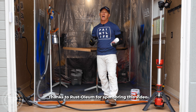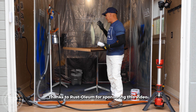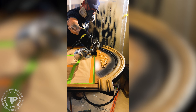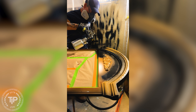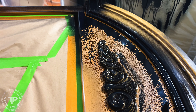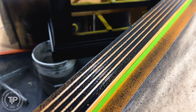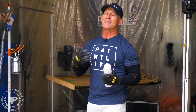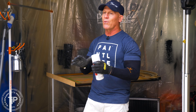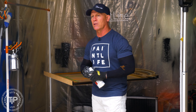Today I'm going to be talking about resolving fisheye problems and priming furniture. If you haven't heard of the term fisheye, that's a result of what happens if you've got a contaminant on a piece of furniture, cabinets, or some type of wood painted surface where the paint or primer will fisheye away in a circular pattern. There's a surface tension difference between the contaminant and the substrate, and it causes the coating to flow away in circular patterns.